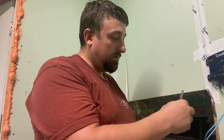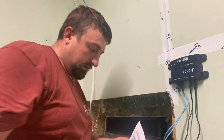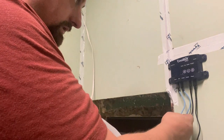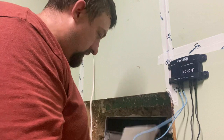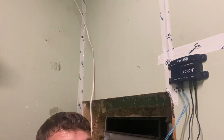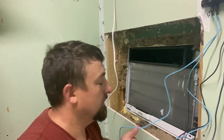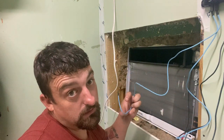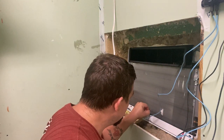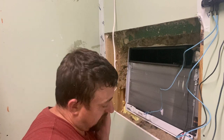We're taking foil that they provided with the CoolBot. We're taking the heater wire that they also provided, and we're combining the two together into here. So CoolBot does a really good job of giving a diagram, and it gives pictures for us idiots. All right, so I am inserting the fin sensor cord, just the tip, into that. That holds pretty good.